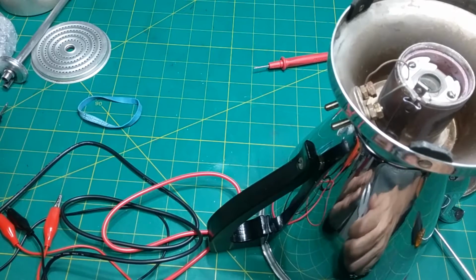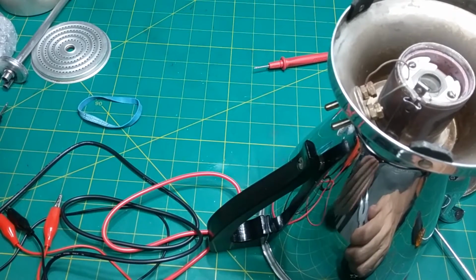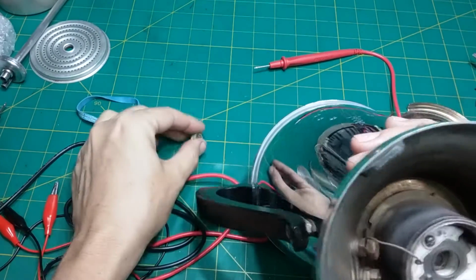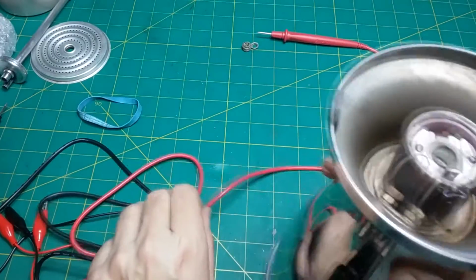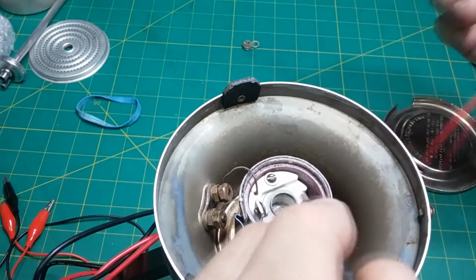I don't know if I can get that out of that cap. No. That's just weird. And that screws down and hits in there. That may be the fuse material itself. And in there is like a little square or something. Oh yeah. Let's see if we got continuity from the inside of where the fuse goes to one of these prongs.